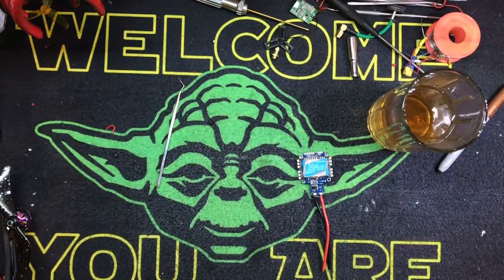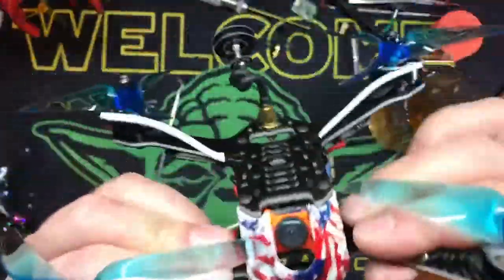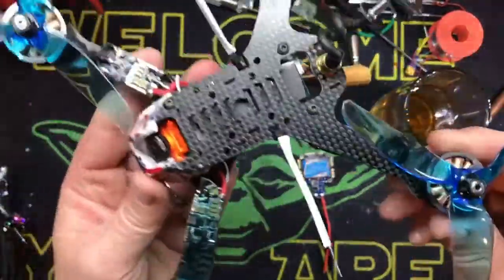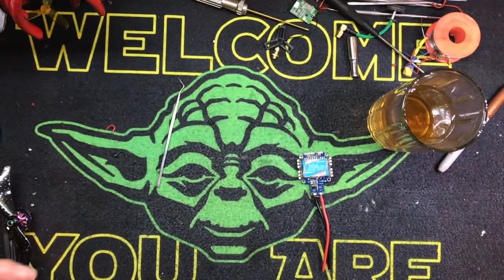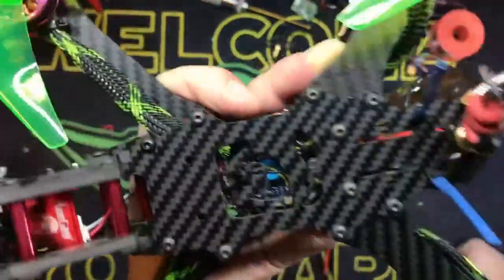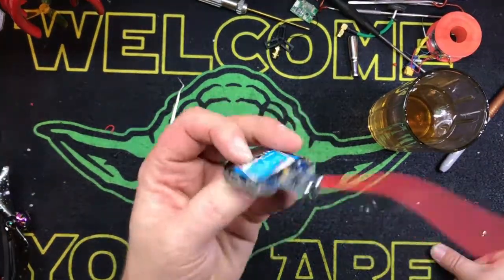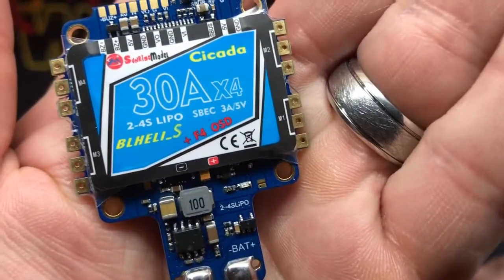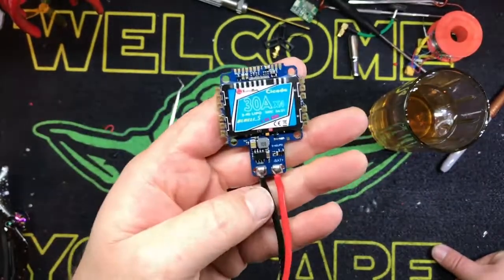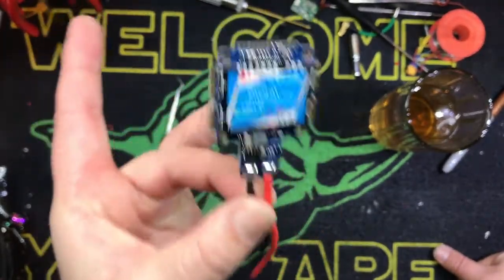If you're using an all-in-one, here's the HyperMod Mocha Simplex Pro — that one I used bullet ESCs, nothing super fancy, but it was built quickly and I love it. Remember the Berserker? This one also has the Cicada. I like it so far. No heat issues. It's got a 3-amp 5-volt BEC, so you can run your camera and your VTX — I run 5-volt VTXs — without any brownouts, which is very, very good. That's something you want to look at.